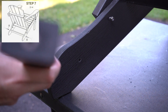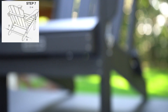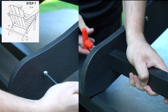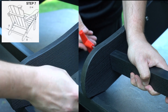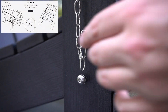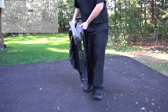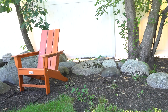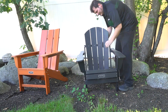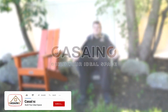The final step is attaching your chair's back leg support bar, Part H. Using two 35mm bolts, thread through the outside of the back legs and into the side of Part H. Screw the bolt until it's completely inserted. If you need to move your new chair, you can pull out the tab from Part L on both sides of the front legs and fold it away for easy travel. You have now assembled your CASA Inc. PS Board Folding Adirondack Chair. Be sure to comment any questions or tips down below, and follow us for more instructional videos.